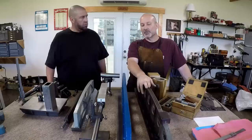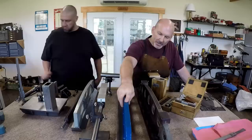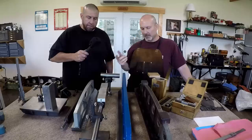And I really like, for whatever reason, these Brown & Sharpe straight edges, but they don't have dovetails on them. This one is a Richard King, so Kingway Consultants. Richard still has these straight edges cast. They're great, and he's a great resource. Obviously, he teaches a scraping class.